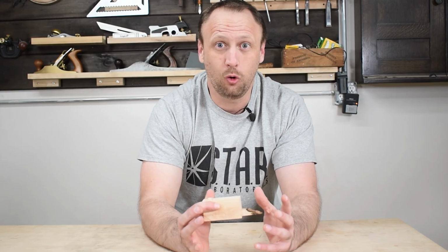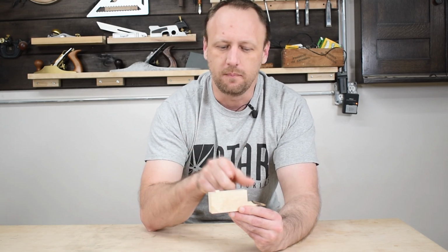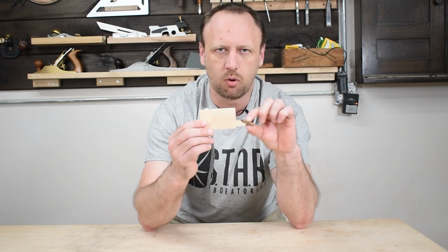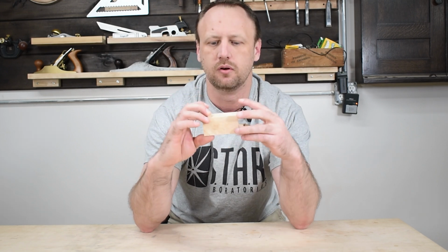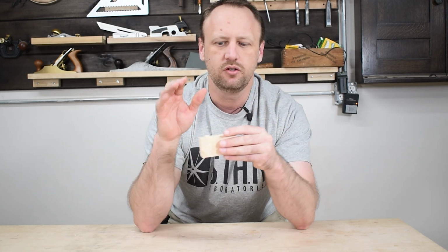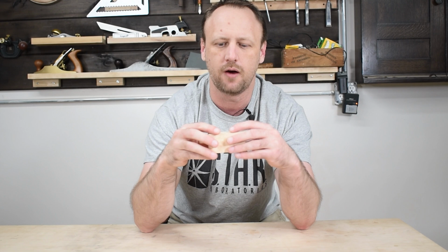Well, that was certainly a whole lot of work, but it's turned out pretty awesome so far. So let me tell you about how I got to this section. All right, so I made the part that has the pins inside the lock and the bolt slides into place and locks into place. Then you got to make some sort of mating section that the bolt will go into. That's usually attached to like a door. Or you could even do a box where the box lid comes down and then the bolt slides into place and it locks the lid so it can't open back up.